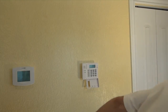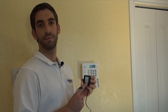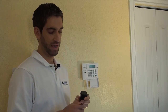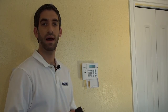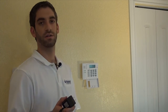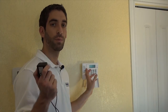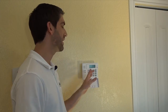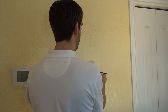That's why many people like to use the K0991 transformer — it's an AC transformer. It's a 5-volt, 220-milliamp power supply with a DC connector on one end and a simple power supply on the other. You plug this into the back of the keypad. It would still use the batteries during a power outage or if the outlet is turned off, the batteries would still work. But when this is installed correctly, the keypad stays awake at all times, so when you open your door it will chime immediately and you don't have to press the star key to wake it up.